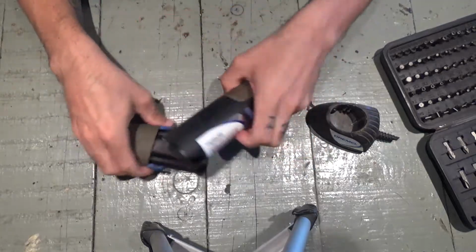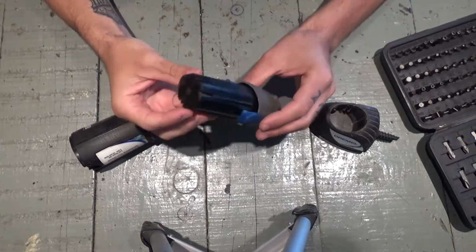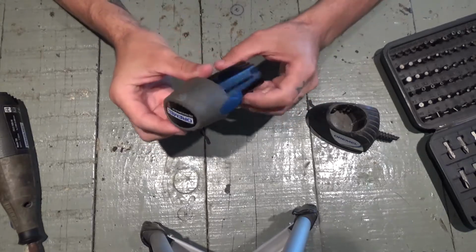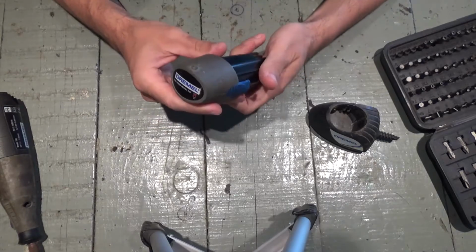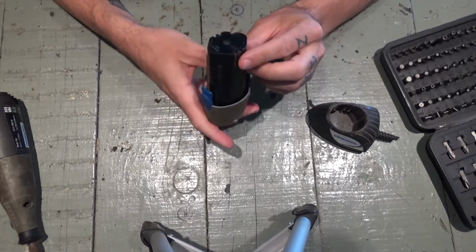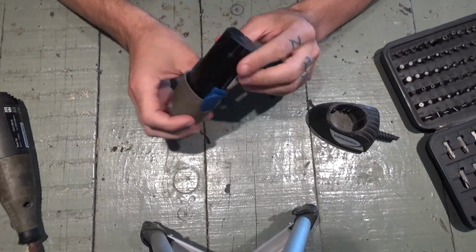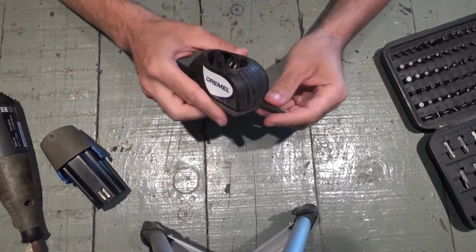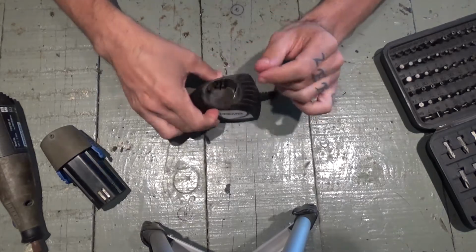It's handy. But the battery, I'm not sure if it is completely dead, or if it simply was drained to a point where it does not charge anymore, because lithium ion batteries have this problem that if you discharge them over a critical point, they won't charge again. So I'll start by opening this, as somebody cut the wire. Not sure if this is the thing which is broken. I'll try and open this and see what's going on inside.